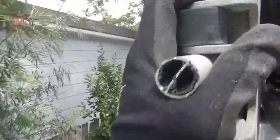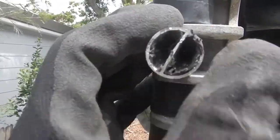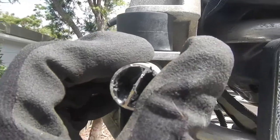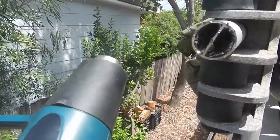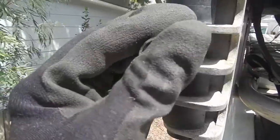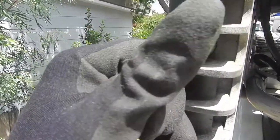Okay, so drilling is not working. Whether there's some sort of adhesive or something in there that's holding that plastic in — I've drilled all but the whole lot out and it's still not enough for the new section to fit in. So we're pulling out the big guns, and by that I mean we're going to hit it with the heat gun. See if we can soften that up a bit and then remove it that way, because right now we're not getting anywhere with this. You'll see I've stuck on gloves because I'm going to need to manage this, and that's going to get pretty warm.